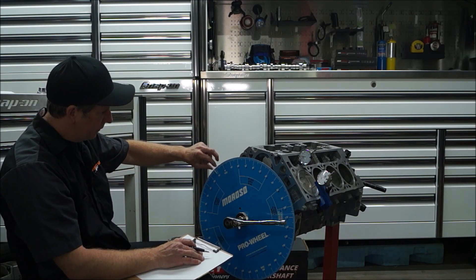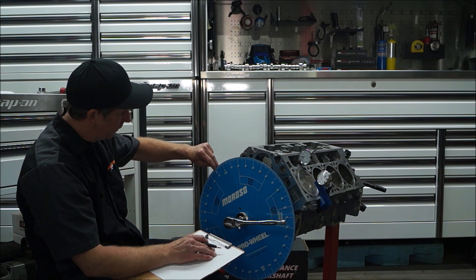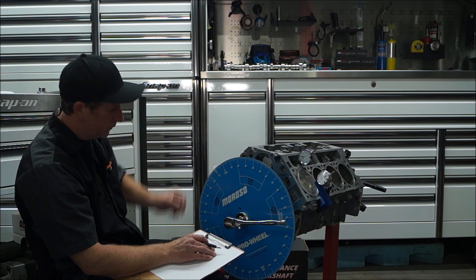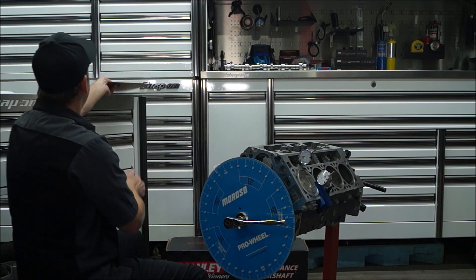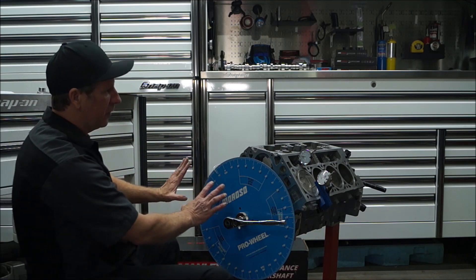So I can tweak this by loosening this and spinning it, or I can barely bend the coat hanger, put it a little bit closer to 11 — that way we are going to be more 11.5 on each side. Got it. Now you want to recheck that, and after that is done you know you are on top dead center.